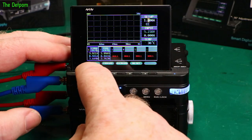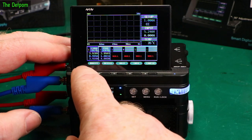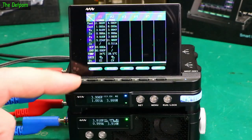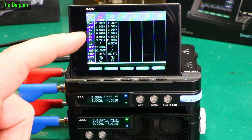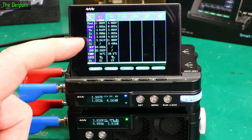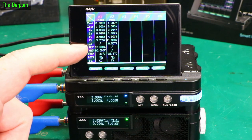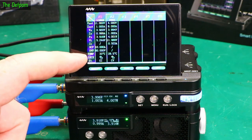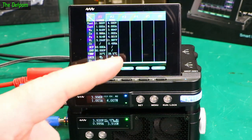Other things we can do - we've got an Info screen which gives you more information about what's going on: voltage set point, current set point, voltage out, voltage in, current, power, overcurrent protection, overvoltage protection, temperature, lock state, and status. So obviously the power supply is doing constant voltage and the load is doing constant current. But we could actually tell the load to do something different.